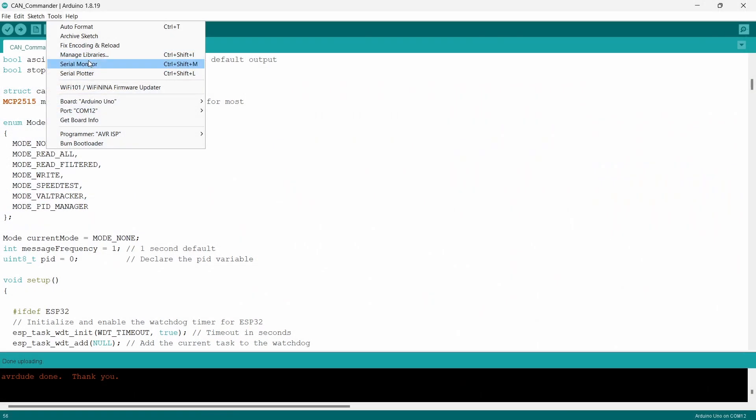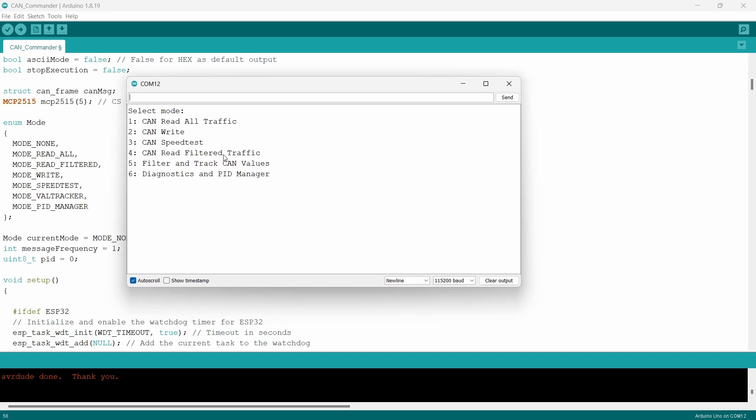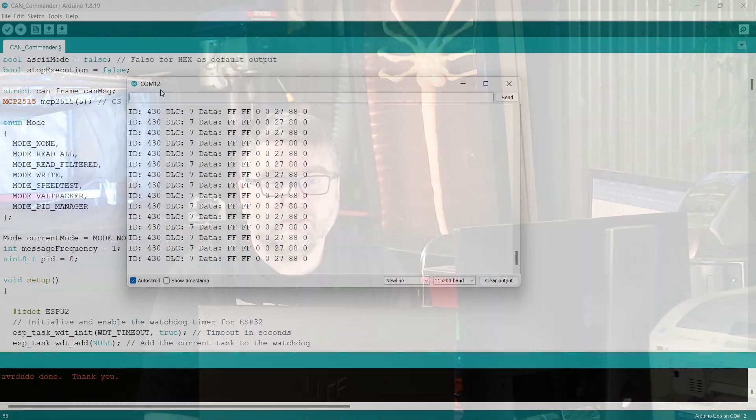Once you get the firmware flashed and open the Arduino console, you get this menu. The two items we're really interested in are 'CAN read all traffic' and 'CAN write'. Hit number one and it starts spewing out data — that means your CANBUS is up and running. If you've got nothing, check the wiring from the MCP2515 back to your Arduino, and check your dashboard power wiring. For me, as you can see, it's spewing out this code, which is CANBUS language — so it works. Technically if I can read, I should be able to write to it as well, and if I knew the codes to send to my device I could pump them in with CAN write to make things work.